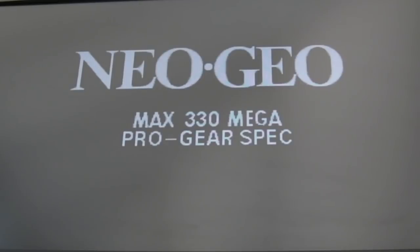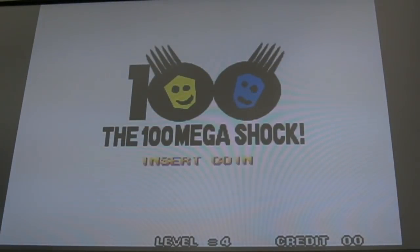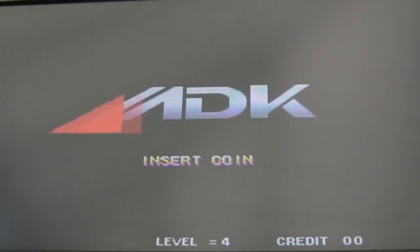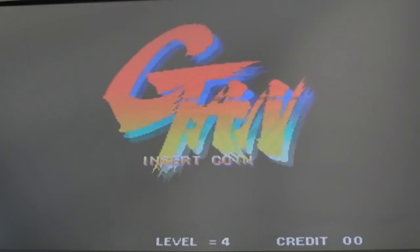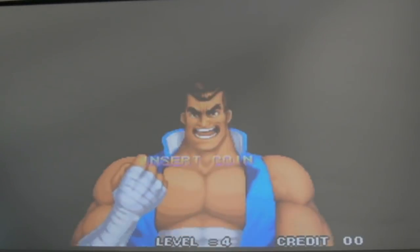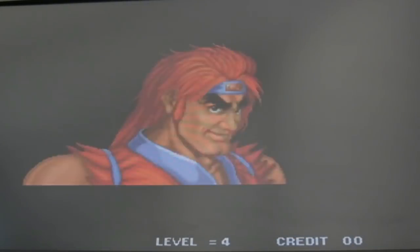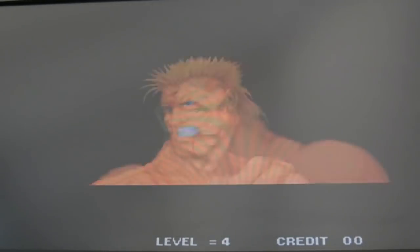Yeah, just testing the other slot, the graphics are fine, we're just lacking the sound, so there is just a sound issue. I've got the feeling the sound issue is going to take me ages to work out. It's got to be something really weird, like a via in the middle of the board or a trace somewhere underneath the slot that I can't see. So yeah, this I'm not looking forward to trying to resolve. I've tried moving the cart, reseating it, etc. Doesn't seem to make any difference, there's just no sound on that slot.